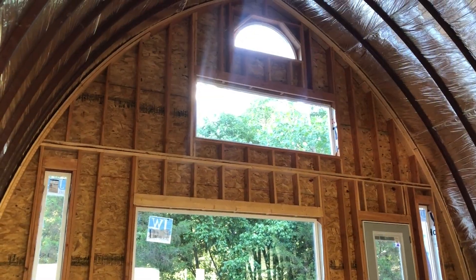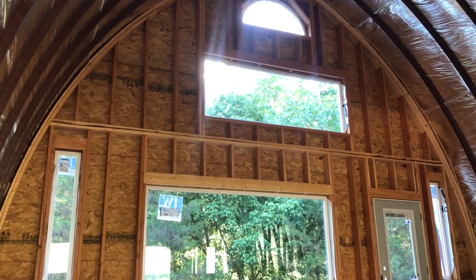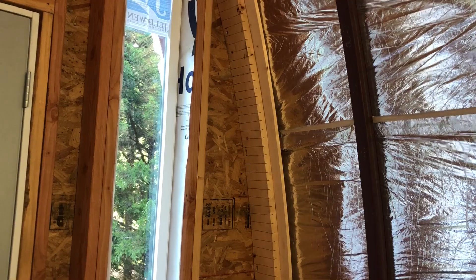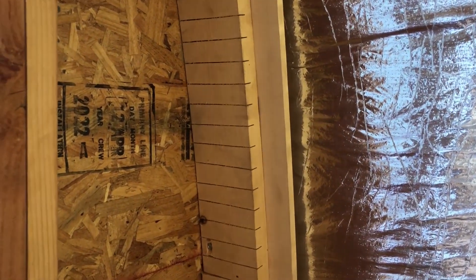This is the front end cap and you can see all the carpentry work has been completed — all the framing as well as the OSB on the exterior. One thing unique about the arch cabin build is that because it is arched, we had to have some framing that would arch along those steel ribs as well. This is a 2x6x16 board on the bottom — it goes from the bottom up about 16 feet, and then there's another one, I think a 2x6x9. The carpenter actually sliced this board about a half inch every inch, which provided the flexibility needed to put it up against the arch rib.